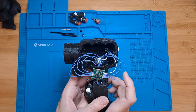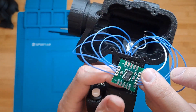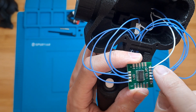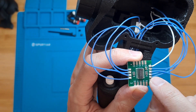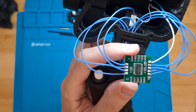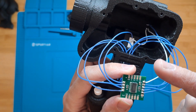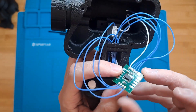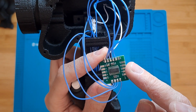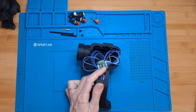That's it — here is how it looks. The common wire goes to a ground pad, and then each individual wire is connected to one of the eight digital inputs of the shift register. The top and bottom pads are the ones that will connect to the other shift registers in the chain, and at the last shift register the out pins are the ones that will exit the grip and go inside the enclosure.